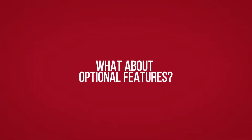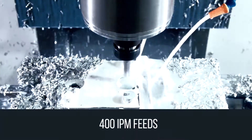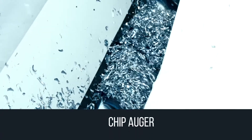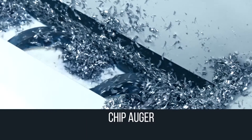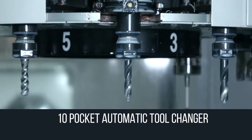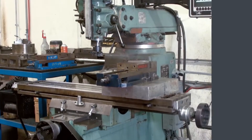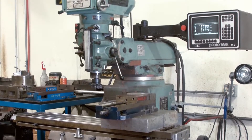What about optional features? Absolutely. Want to up your productivity levels? Then choose a 6,000 RPM spindle and 400 inch per minute feeds. Add a chip auger to take care of those chips efficiently. And definitely think about the time you're going to save when you add a 10 or 20 pocket tool changer. Trust me, that knee mill is definitely not going to change tools by itself.